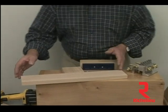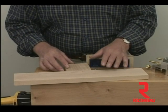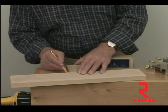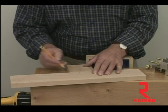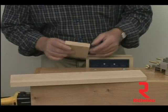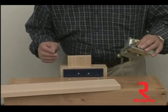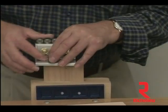What you would do initially is measure this particular longitudinal piece, determine where this spar is to go, and once that's determined, line there, exactly the same procedure as before, check mark to check mark, check mark to check mark. Place the first workpiece, secure it firmly in the vise. Same procedure, check mark to check mark, check mark to check mark.